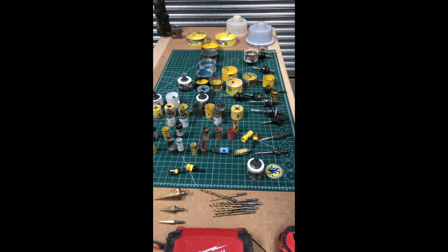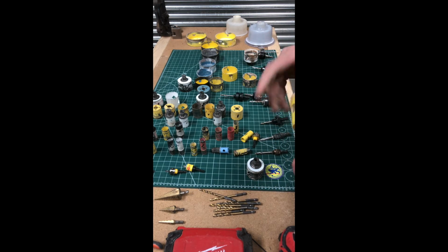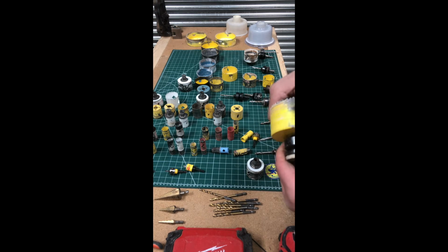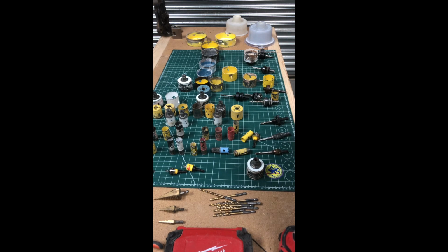So basically, the little trick I was going to show you will help commercial or domestic, because now with downlights, we're all using the hole saws. And you know when you get them, they get so tight on there, even if you use the pins. If you run a little bit of copper around like this, because that's soft and that's harder metal, it's not impossible, obviously, because nothing's impossible, with a bit of WD-40 and all that, but it never tightens up.